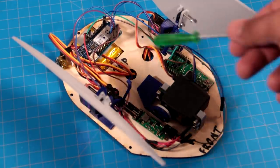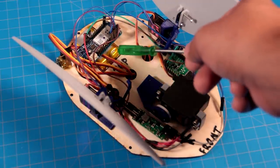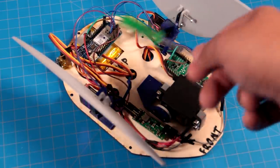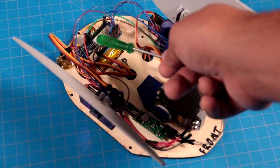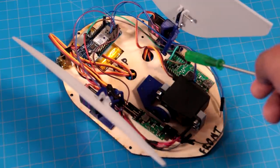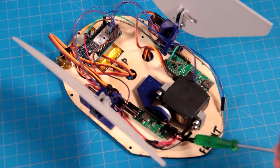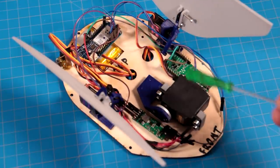Let's take a quick tour of the electronics — not my tidiest work. Starting with power: at the heart we have the LiPo battery, which feeds directly into the 5 volt boost converter. This provides 5 volts directly for the two flap servos and the main gadget servo. The 5 volts is also tied to the MKR1000, which has a 3.3 volt regulator powering the SpeakUp Click. The SpeakUp Click connects via two wires to the GPIO on the MKR, and the MKR connects to the signal lines of the servos.